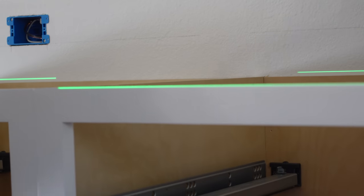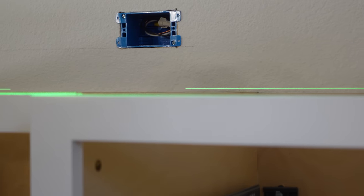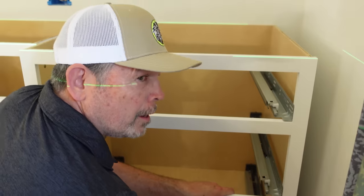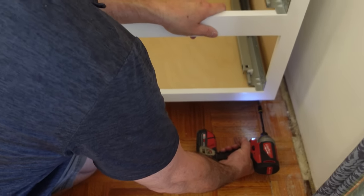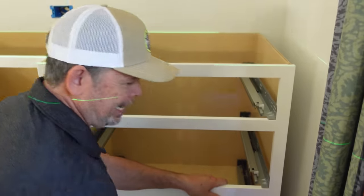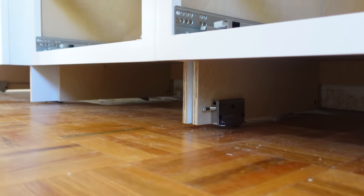Check that out. All right, let's work my way to the right. I think that's good. All right, let's get this back corner up. I can't imagine doing this with shims. Look how easy that was. I just picked it up 1/8 of an inch with a squeeze of the gun. That's awesome. The top adjustment rod is the back. And watch that back come up.